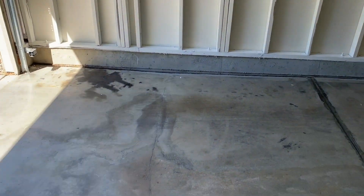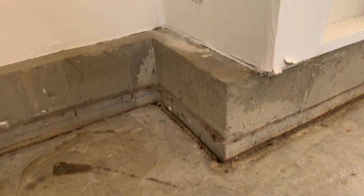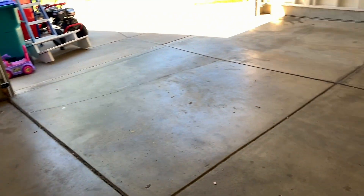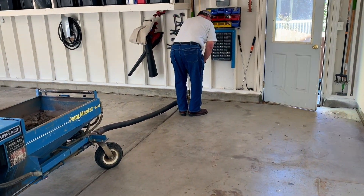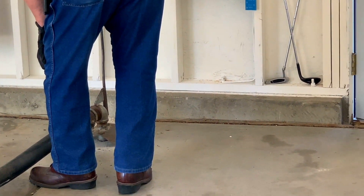The first optional step I did was mud jacking, because my garage floor had sunken tremendously — that corner was down about four to eight inches. All six slabs had sunk, water was no longer draining out, and pooling in the corner and on those front slabs by the door. They drilled holes and used a machine to pump mud underneath the slabs, raising them back to their original position and leveling the gaps between slabs.